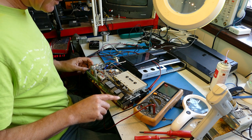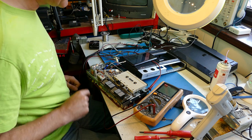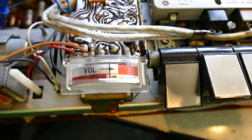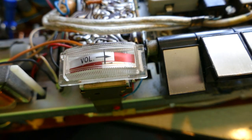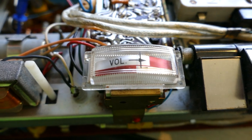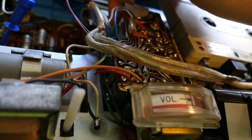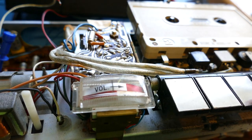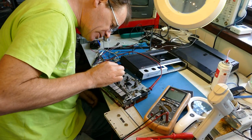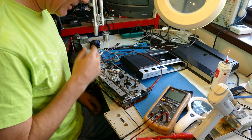So I'm going to release pause and see if we get a recording. It's wobbling about a bit, but we should be recording 1kHz tone. The volume level was right. Now the machine seems to have stalled again — let's give the motor a bit of a kick. Now that's running. We've stopped for some other reason. The motor is running but the tape is stopped. Nothing's ever easy. The belt appears to have fallen off or snapped. There we are — that's why we've stopped. So I now need to change the drive belt.